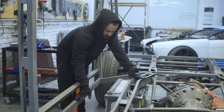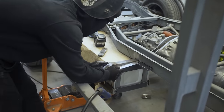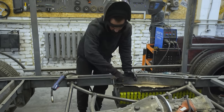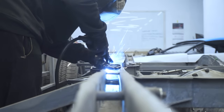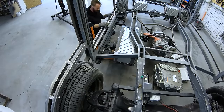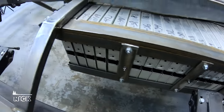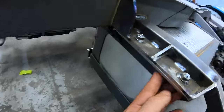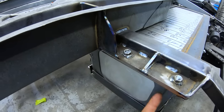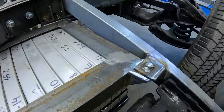We have sets of plates with cage nuts for reinforcement braces, distributing load evenly within the spars. Now we're gonna weld. While Nick installs the batteries, here's a bit about the project: at the base we have all components from the Nissan Leaf. We don't know much about electric cars, but the DP Labs team does - this project is a collaboration, with all parts and technical support on their shoulders. The structure has suspended boxes with mating plates underneath, cage nuts screwed in and assembled from the bottom.